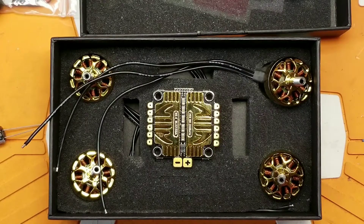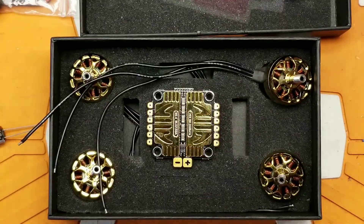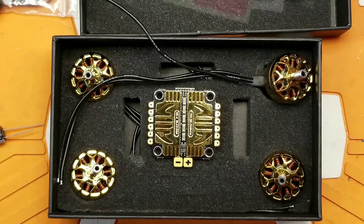In my personal experience, cheaper motors like the SunnySky and the Emax Eco motors definitely can't stand up to the same abuse as higher-end motors. Some of that is driven by price point, and some has to do with bigger bearings, heavier duty shafts, different materials, tighter tolerances, and thicker bases. Sometimes in this hobby you do get what you pay for — but if all you can afford is the cheap stuff, whatever it takes to get you in the air, go for it.